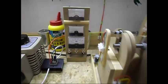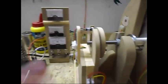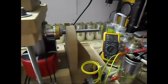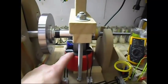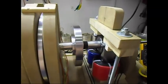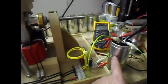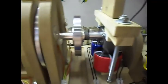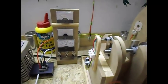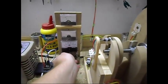What I'm going to do now is turn down the variac to 0 volts and see what happens — zero, switching it off, no input. As you can see the voltage in the capacitor is also decreasing and the system is slowing down. Two reasons for this: one is that the dynamo at this point is not producing as much energy as the drive side is using, and the second reason is the universal one — the dynamo being loaded by the drive side puts a lot of stress on the drive side.